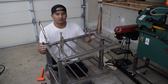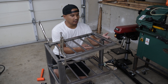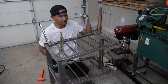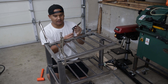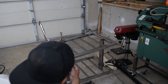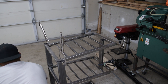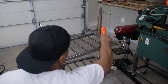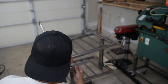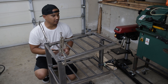To get the frame jigged up, I clamped a spare piece in the middle so the top rack had something to rest against. To get the desired angle, I used a digital angle gauge and adjusted it to 95 degrees because I was on a slight ramp. I used a rubber mallet to tap and slide pieces into perfect alignment, then clamped everything down and was ready to weld.